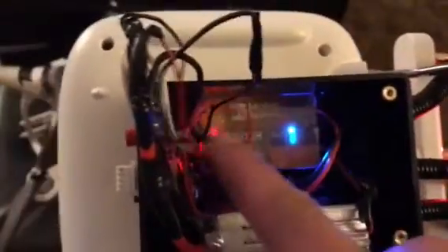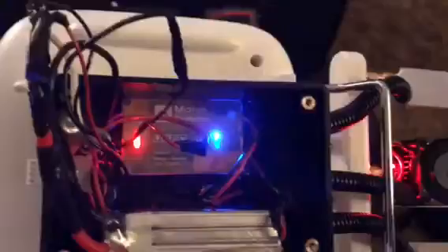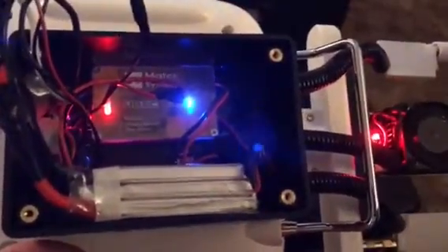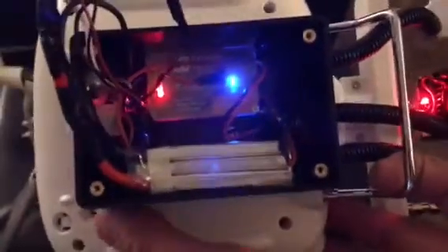I included in the bottom of mine plugs to charge the LiPo as well as a switch to turn everything on. The nice thing about this BEC is that once you set it to the voltage you need — which for this amp is 12 volts — it stays there. So when you turn it on you're good to go; you don't have to open it up or change it each time. It saves that setting for you.